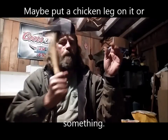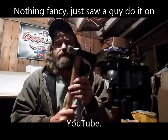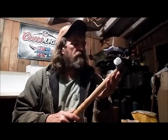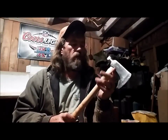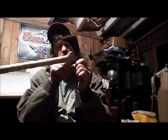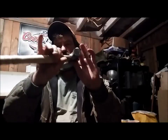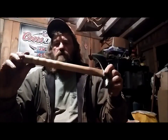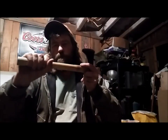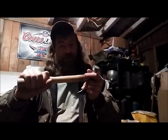I'm gonna replace this handle. This is the dowel rod - I make little cheapy throwing tomahawks out of it because they get out in the pasture and I can't find them. I'm gonna get a regular hatchet handle, but when I get done with it I want it to taper up so when I choke up on it, it still has that knob. These little ridges - that's something my brother taught me to do. When you're swinging a hammer with gloves on, you need something that'll catch your hand. We were both welders.